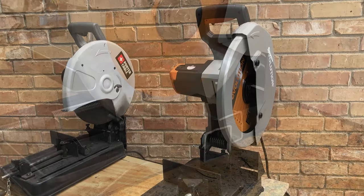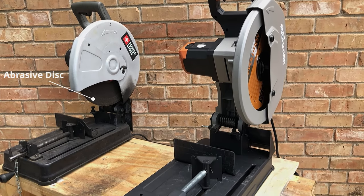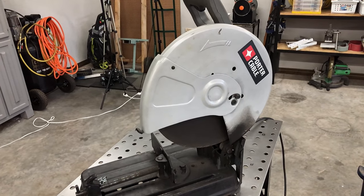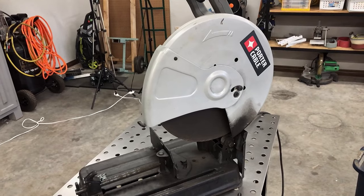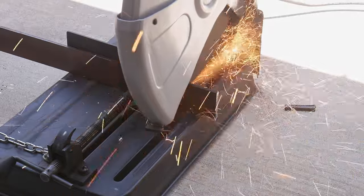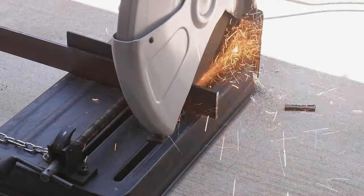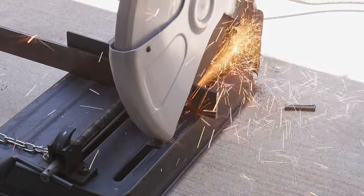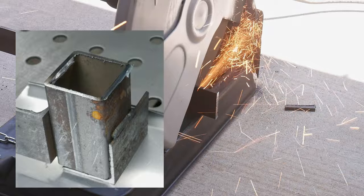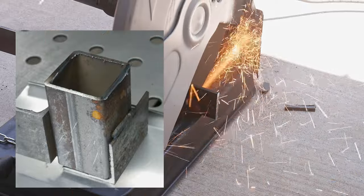There are two common types of chop saws. The first style is the most common and uses an abrasive disc run at a high RPM. I've been using saws like this one since my teenage years when I first started welding. These saws can be purchased at a relatively low price, but in my opinion come with a few drawbacks. Firstly, they produce a large amount of sparks and metal dust, since they're designed to abrade away the steel that you are cutting, combined with the high RPM — normally around 3,800 RPM — making them fairly messy. Secondly, the cuts produced by abrasive chop saws generally require a fair bit of deburring, which extends metal prep time for your project.